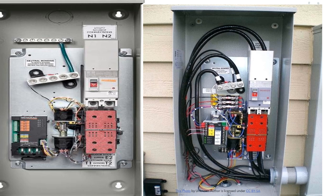Today we're going to be looking at automatic transfer switches. The one on the right has been pre-wired and it looks pretty clean, and the one on the left is unwired — I wanted to show you both. In this scenario, we're going to imagine that you're coming straight from the meter with no disconnect in between, and this is going to be your first point of disconnect.